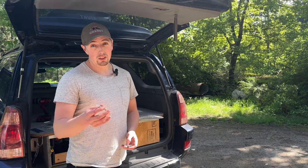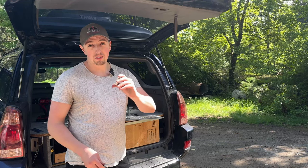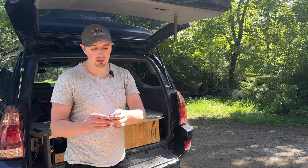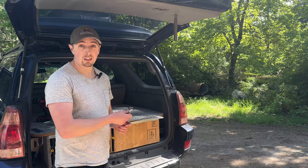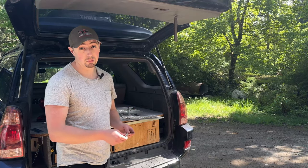All right, so unfortunately the bolts that I bought are just a little bit too short. The length of standoff that I need is probably about 2.5 inches, and I just don't get enough thread engagement to hold it on there securely. But I'm gonna continue marching forward on this design and this style, and then we'll try to go to the hardware store maybe when this paint is drying on the Molle panels.